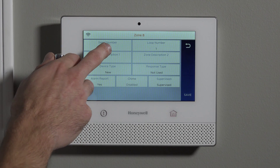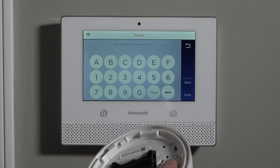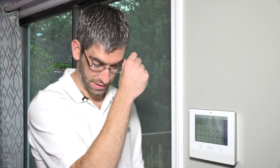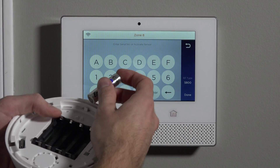On this part, we hit Serial Number, and now we're at the screen where it wants us to enroll the MAC address. The MAC address on this device is found right here on the unit. This siren is actually a little computer — it has a 16-digit unique MAC address which communicates to AlarmNet servers. This device can be firmware updated so that as new features are released, we can update the specific sensor along with the panel. You're not buying new hardware every time something new comes out, which is a really awesome addition to the Lyric.